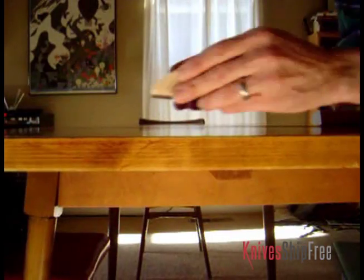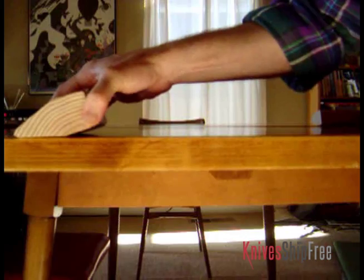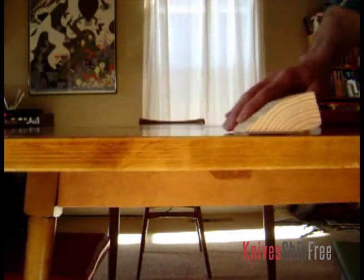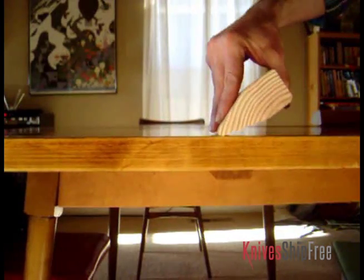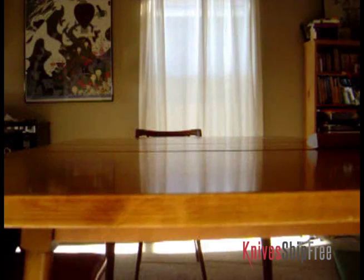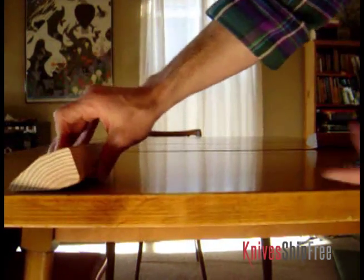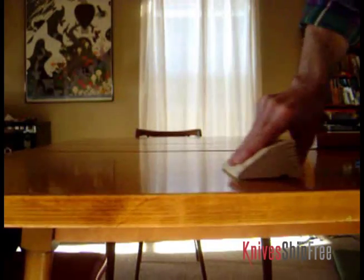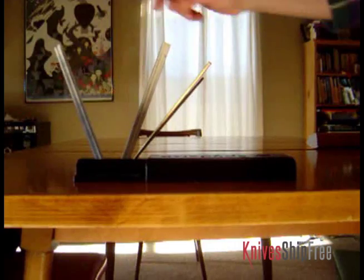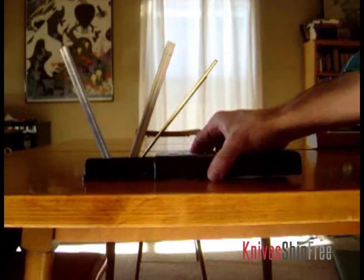By contrast, in maintaining a beveled edge, which is just flat surfaces, you lay it flat on a block and you run it. Either forward, typically forward, sometimes backwards. And then to get the secondary bevel, you tip it up and sharpen like that. With a beveled edge, there's a lot of options, but since it's only a game of flat angles, a lot of people use a flat bench stone. People have always used that. Or there's a variety of excellent devices on the market, which again, are mostly predicated on the idea of establishing and maintaining a fixed and stable angle.